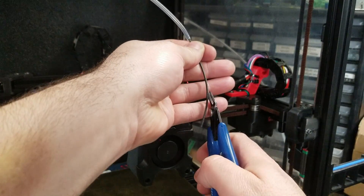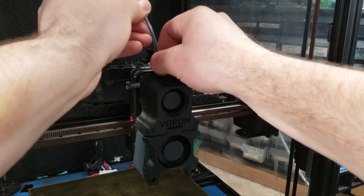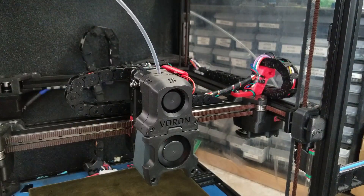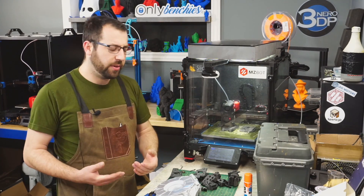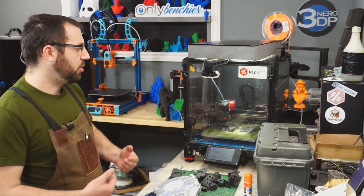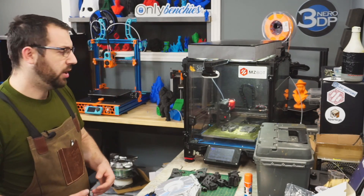The next trick is to have a separate bowden tube feed the filament into your printer itself — this is what's called a reverse bowden setup. For this I use a 3mm ID bowden tube. This helps a bit with additional moisture trying to get into the filament, especially if you pause or there are gaps between printing with the filament sitting out. Also, with the 3mm ID this helps a lot with preventing friction, as filaments such as CF nylon are abrasive and cause friction in a bowden tube, minimizing the work your extruder has to do to pull filament into the hot end.